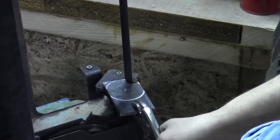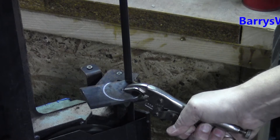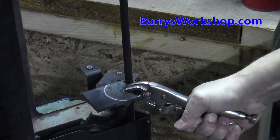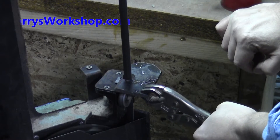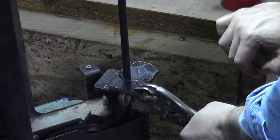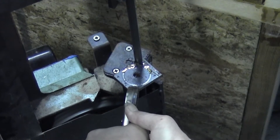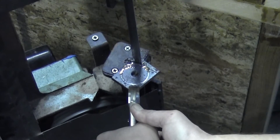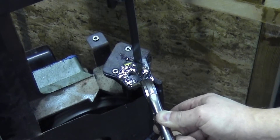So I'm going to make a new plate that's a little bit larger, and I'm using some three sixteenths — or five millimeter — mild steel 1018. I'm going to cut it to rough shape on my metal cutting bandsaw. There's a smaller circle for the inner piece, and then I'll join these two pieces together later to make the finished part.